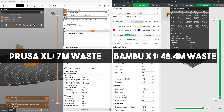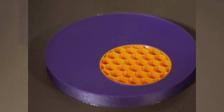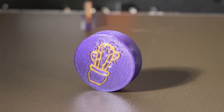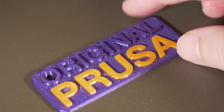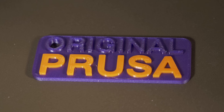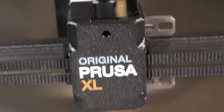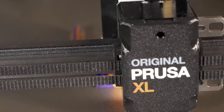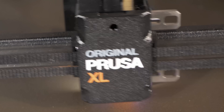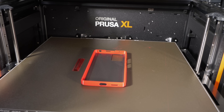In terms of print quality I had no complaints — it seems pretty much identical to what you'd expect from an IDEX. With multi-tool printers you have the potential for registration errors between tools, but Prusa's calibration process does seem to address that, with prints coming out just as well as on a single-nozzle machine. Regarding the stringing seen in early reviews, this can be down to filament or slicer settings like retraction. I said from the start that the original 0.6mm nozzles were not the best choice, as they're more prone to stringing. The XL now ships with 0.4mm nozzles, and this machine does not string that much.